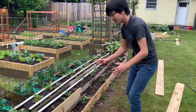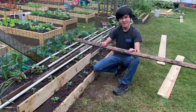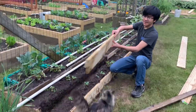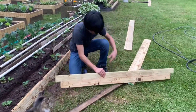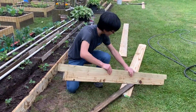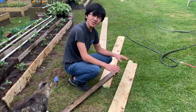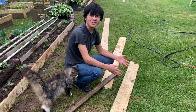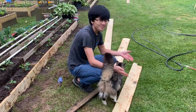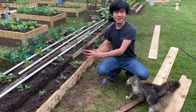When you do this, make sure you don't use pretty bad wood for these mid-sections right here. You want to use something like this — this is thick wood and it's pressure treated. You don't want to use something thin. By the way, these planks are about $6. They used to be around for less, but because of the pandemic they've gone up like $1. So obviously this design is not going to be less than $10 anymore. Just keep that in mind.